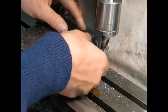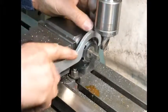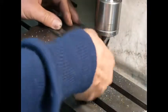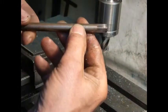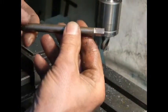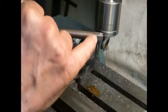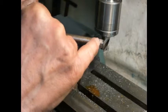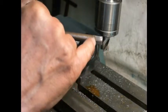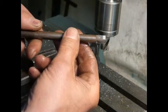And the job's done. Just take it out of the collet. So there's the finished job — four equal flats. You'll notice that I didn't go quite down to full depth, so we've got quite a pleasing rounded corner on each of the flats, and I quite like that.